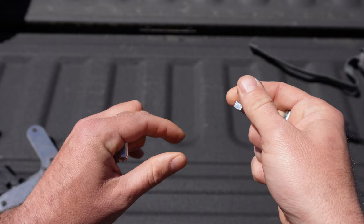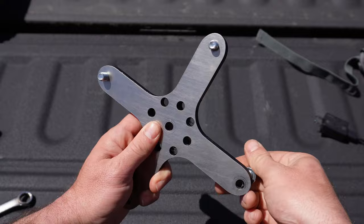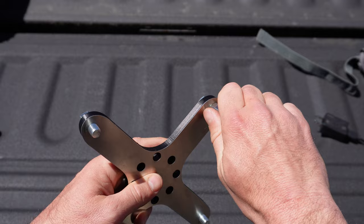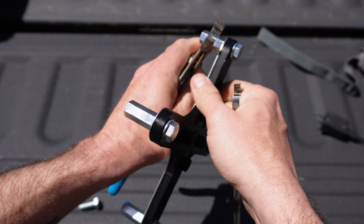Additionally, I'm going to need 3/8-inch 24-thread bolts — these are inch-and-a-quarter — I picked them up at Ace Hardware. On each of those bolts we're going to put a lock washer in place, then place each bolt on the outside holes of the plate. Once the bolts are in place, we're going to take 3/8-24 couplers and place them on top of each bolt. Then I tighten each of these bolts down — not so tight that it breaks the base plate, but tight enough so they don't move around.